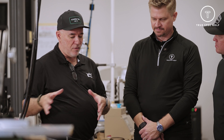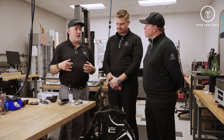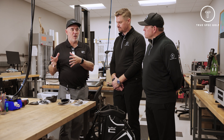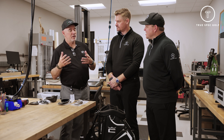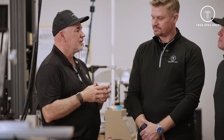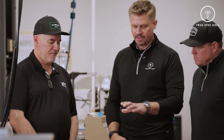The science of golf clubs has evolved to be about making systems — I almost think of it more like tennis rackets. A tennis racket has flexible strings in a relatively stiff frame. The old school of thumb in golf was stiff, stiff, stiff is better, and we learned in the late '90s that flexible is actually better because you don't squish the ball quite as much. You're dealing with the coefficient of restitution, and that's why we design these structures to be more flexible — but they still have to hold up. Everything in the golf club, even the badge on the back, is a symbiotic relationship to make that golf ball go as fast as possible.